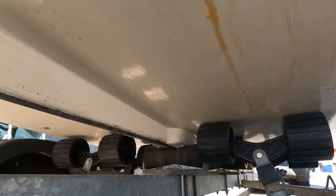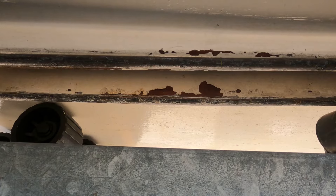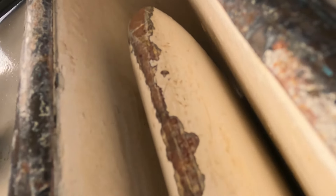There is considerable rust staining on the bottom hull from the transom outboard bracket old washers, along with some patches of flaking paint where old trailer rollers caused paint damage on the lower chines. The bottom of the centreboard case needs sanding and recoating, as does the edge of the centreboard. But as far as I can see, the protective fibreglass epoxy layer remains undamaged even though there is some staining. I last painted the centreboard case and actual centreboard about three years ago.